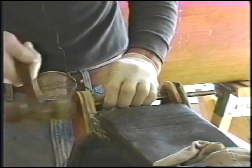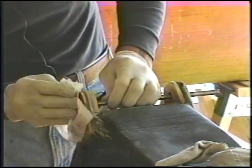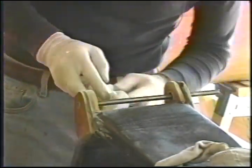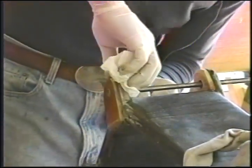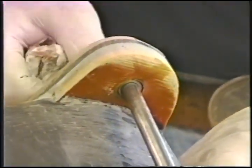Go right up flush with that. I'm reluctant to use a hard hammer because it can mushroom the end of the bushing. I'm within 10 or so thousandths of this edge. I'll show you. With the bushing, very close. If I tap this in the rest of the way on this end, I'll be flush on the opposing side.